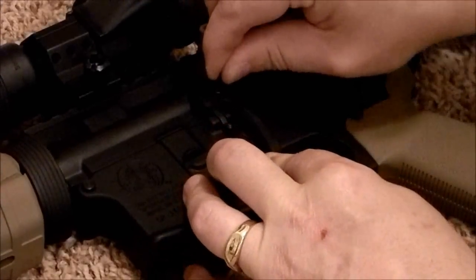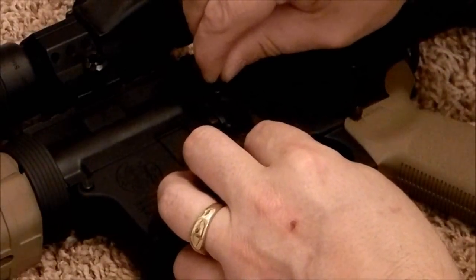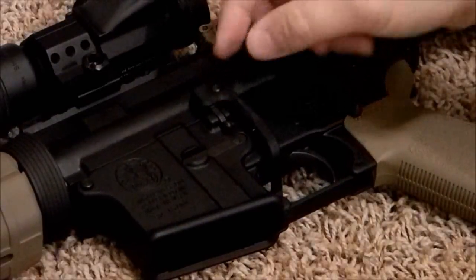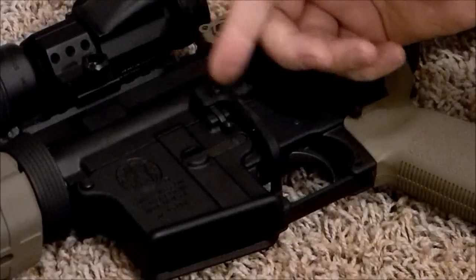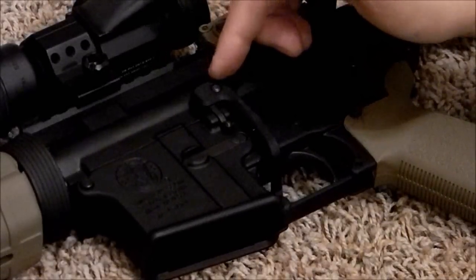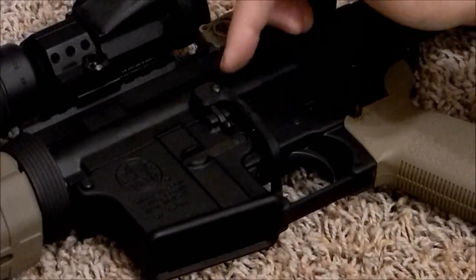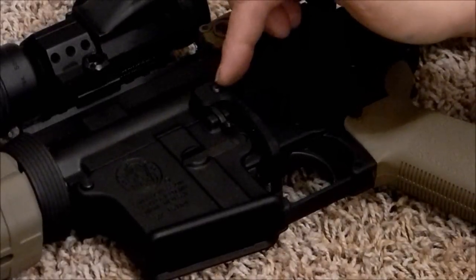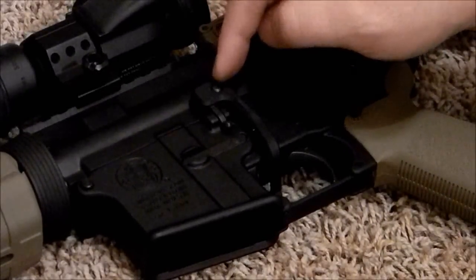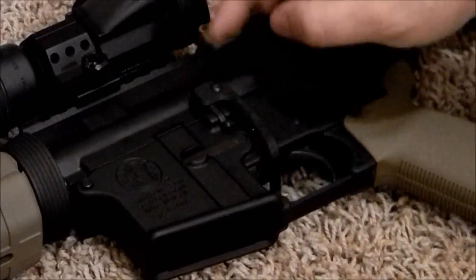That's just something to keep in mind for those of you who might be newer to working on guns. When you get a screw, look at it and if the side of the screw has some dried blue material around the threads, that's Loctite — it helps hold the screw in place from backing out. When tightening a screw that has it, it'll be pretty easy to screw in until you get right to the point where the Loctite is, and then you'll have to push through that and it'll be a little bit harder.